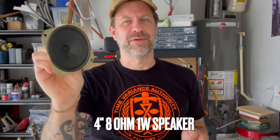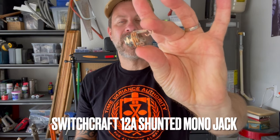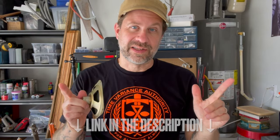Now the kit comes with a tiny speaker, but I actually have this — I don't remember where I got it, but it's like a four-inch speaker I've had around for a while. I think it came out of an old radio or something. I'm going to use this speaker instead. I'm also going to use this Switchcraft 12A shunted mono jack. What it allows you to do is hook it between the power and the speaker, so when you plug a cable in, it disconnects the speaker. I've got a couple other videos about that — I'll link one up here and in the description below.